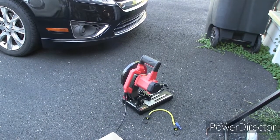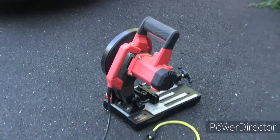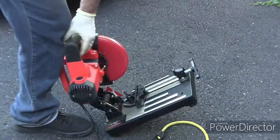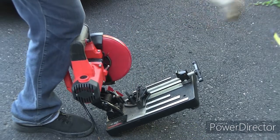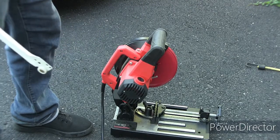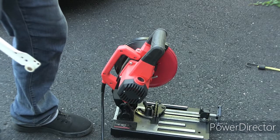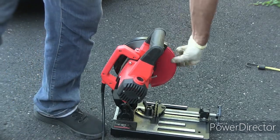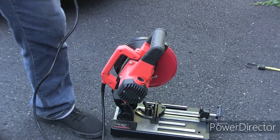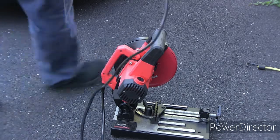While I got you here, I'll show you this little saw I picked up a couple years back now. It's a Trejan 700. It cuts metal great. It doesn't cut with an abrasive blade — it cuts with a hard bi-metal blade. The metal that gets cut is really cool to the touch after you're done cutting it. It puts all the heat into the chips. I got it on sale a couple of Christmases ago. I think it was about $150 — with inflation, I don't know what this would be now. It comes with two blades and I haven't gone through the first blade yet. I've even been cutting some hard bed frame stuff for a couple projects, and it's cut through it without a problem and it still cuts really well. Let me show you this cut real quick.